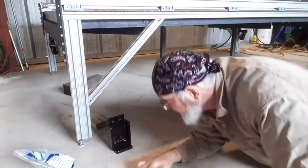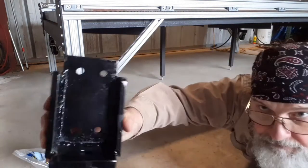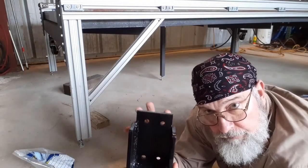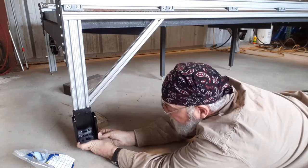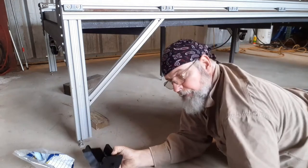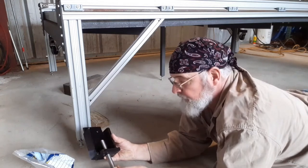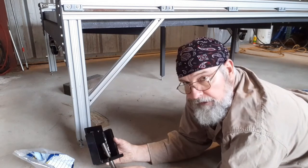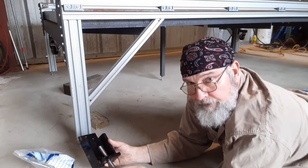So I came up with a solution. Basically, what I came up with is a bracket. It's got four holes in the back. The old carriage head bolts go in those slots. Take a piece of all-thread and a couple of nuts and make like a jack bolt. We'll put four of these on the legs, and I think that ought to remedy the situation.